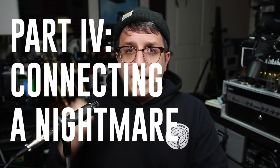Part four — aka everybody's worst nightmare — we are connecting a microphone directly to the camera's microphone input using an XLR to 3.5 millimeter cable. I have increased my gain on the camera to around 75 percent to get a decent level and my god is it going to sound horrible. It is going to be overly hissy and just unusable. I knew it was going to be this bad, but I included this methodology to show you why you do not want to use this method unless you have a camera that has professional microphone preamps built into it.